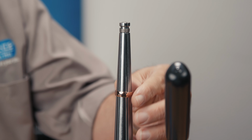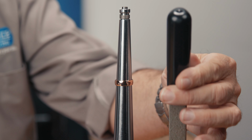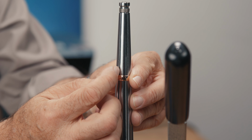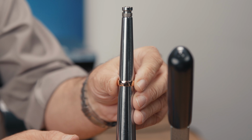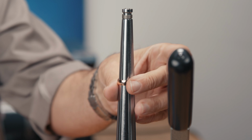Okay, we're also going to slide the ring band on the ring stretcher. Now, as I move the handle up and down, I want to make sure that I rotate it slightly. Otherwise, what's going to happen is it's going to stretch more over the gaps than it will here, just because of the friction. So we move the handle, turn it, move the handle, turn it, then we're going to flip it. That way our ring doesn't get kind of a conical shape.